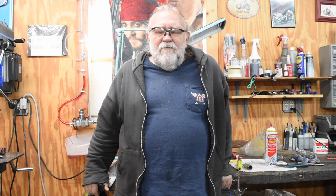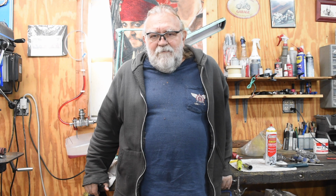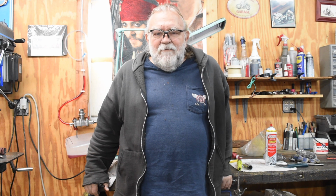As far as the check valve and the ball seat and all that goes, Edison tried 6,000 filaments before he got a filament that worked good for a light bulb. So who knows how long I could mess around trying to find the combo that fixes that. I've tried different oil pump bodies, different springs, different balls, seating the ball, lapping the seat, cutting the seat. There's a lot of combinations to go on that one. So that might be something that gets figured out in the future. It's not going to get figured out now. So I'm calling this little project, this little experiment, over and done.